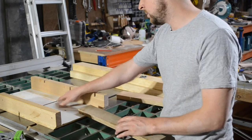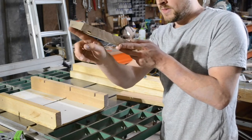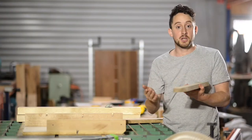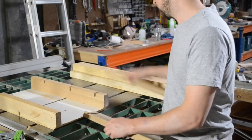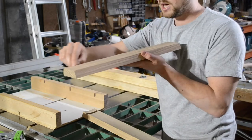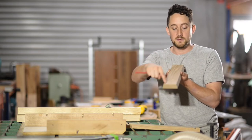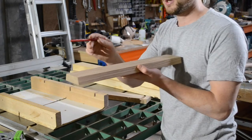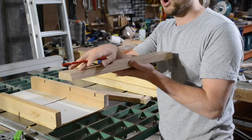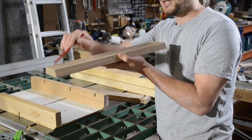I have set this so the blade is just exposed and the curvature of the blade doesn't cut the two sides — it just cuts away some of that meat in the middle. You can use that grey lead trick I showed you before with the chamfer: draw some lines on the edge of your piece of timber that you haven't cut yet. Do a little test and make sure that those faces are retained. You want about a millimetre or even less of that grey lead retained while the meat in the inside is removed.